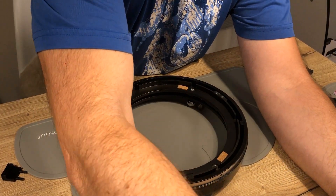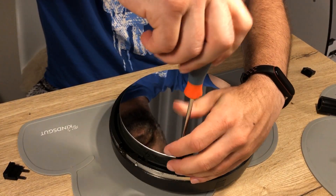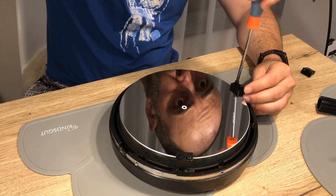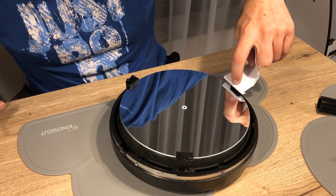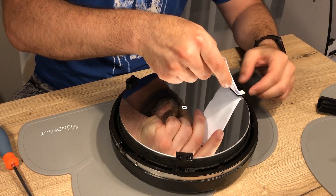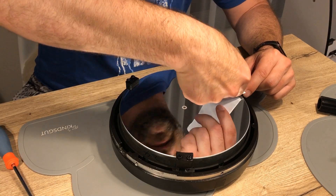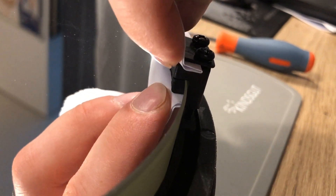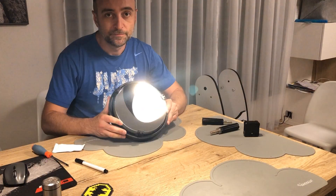Time to put the mirror back. Now we can use a piece of paper between the clamp and the rubber hitting the mirror to give us a little bit of empty space. If you do this too tight, the mirror would be pinched and the image would suffer. So you want to do this between the metal plate at the top and the rubber at the bottom — this way you don't have to touch the mirror at all. And there we have ourselves a perfectly clean mirror.